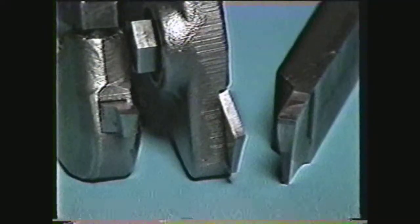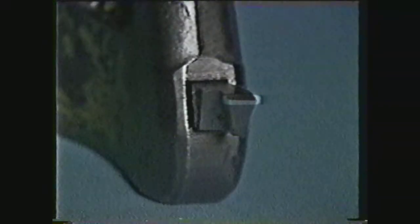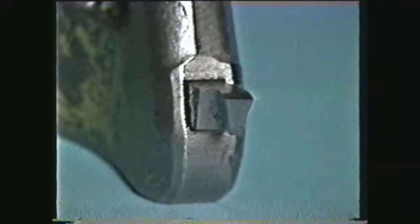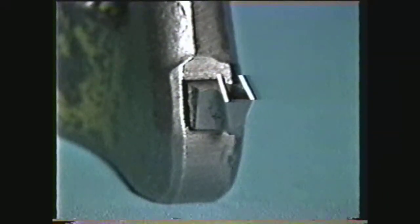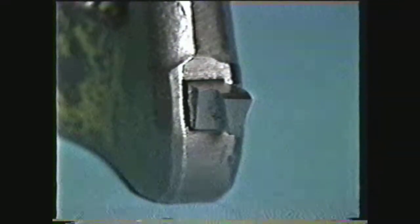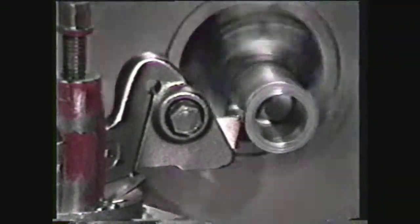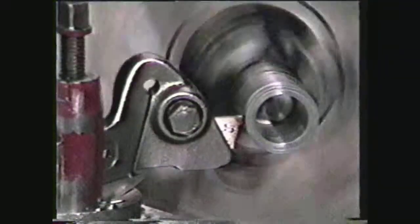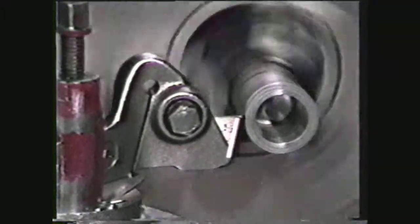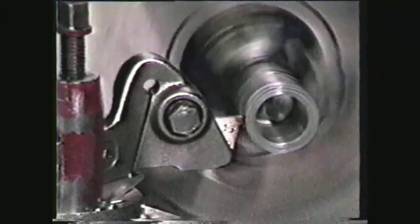All three types of cut off tools are of the same general shape. They are ground so that the nose, which is the cutting edge, is the widest part of the tool. Both sides of the tool are ground with one or two degrees of side relief and one or two degrees of back clearance or flank relief. Back rake is usually not desirable for parting softer metals such as brass. For harder metals such as steel, you can use a back rake of about five degrees to give a freer cutting action and curl the chip. Use approximately 15 degrees of end relief for soft materials and approximately 10 degrees of end relief for hard materials to give added support to the end cutting edge.